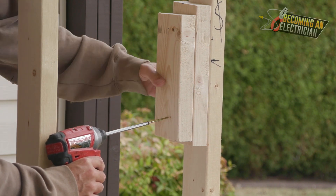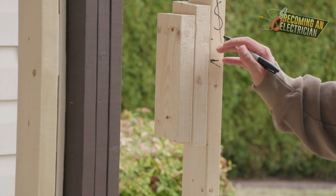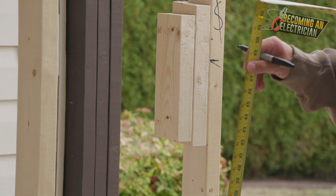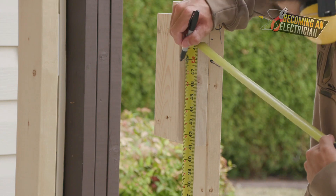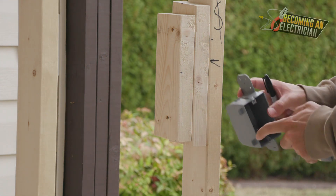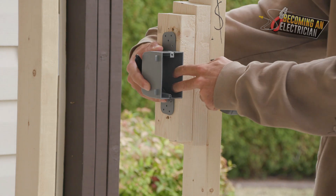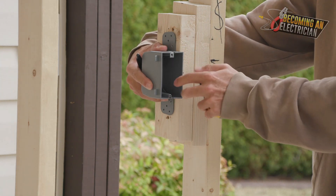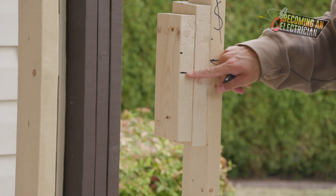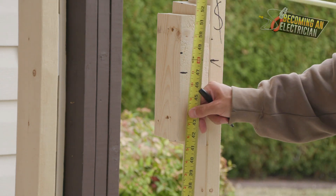That is a solid scab. Now, some people get lazy and just mark close to where the mark was before, but if the engineer said center is right here, how I like to approach boxing is: you're never going to get center perfectly — it's very tricky, especially when you're standing up and have to bend down. It's hard on your back. I would mark top of box, then find what top of box is based on where the engineer said center should be.